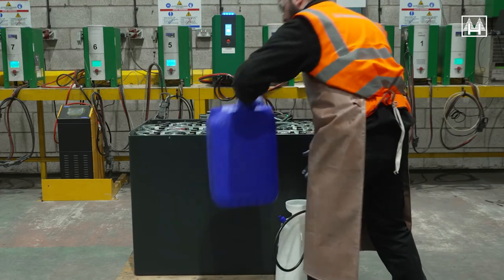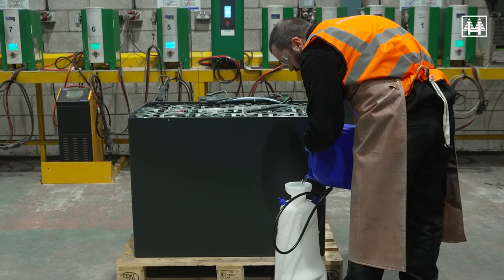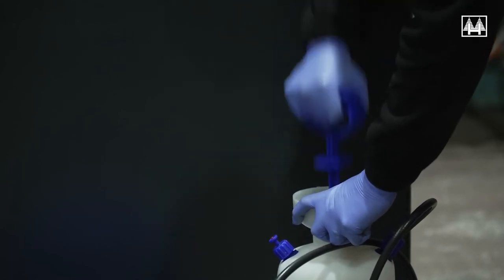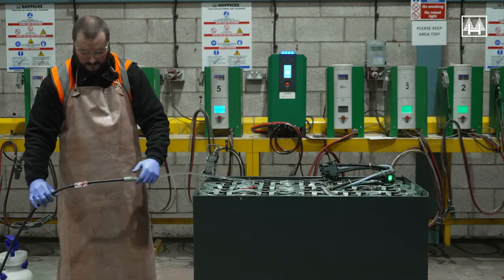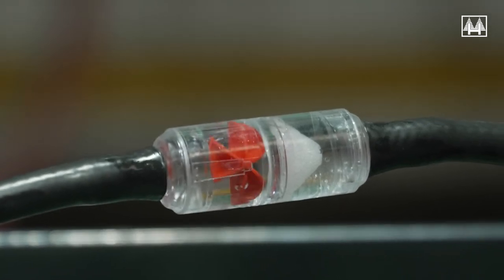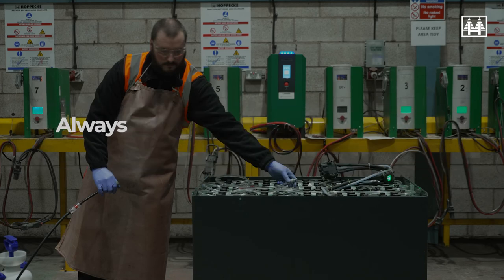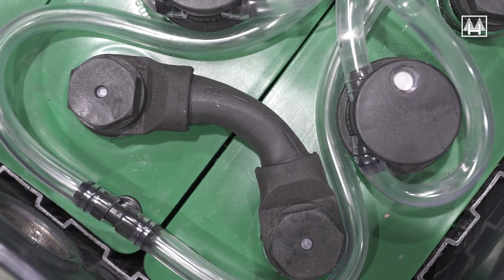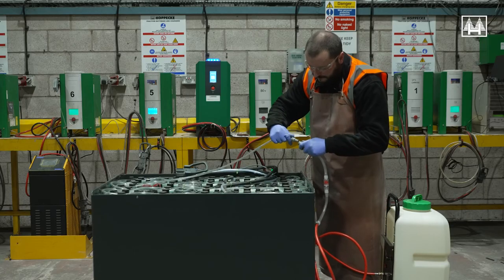When the battery is fully charged, as indicated by a green light, LCD screen, or lamp on the charger, and the electrolyte level light is either off or flashing red, the battery should be topped using the appropriate pressure bottle, trolley, or battery-powered electric trolley. Before using either system, ensure there is sufficient deionized water in the topping bottle or trolley. To use the pressure bottle or trolley, first pressurize it by pumping the handle on top of the unit. When pressurized, connect the male connector on the battery with the female connector on the bottle or trolley. A flow indicator on the supply line should start to turn, showing water is flowing. It is preferable to make and break this connection outside the battery case. Once the wheel stops turning, check all cat's eyes have reached the top of the filling caps and that the bottle has not simply run out of water. The indicator light should also be flashing green.